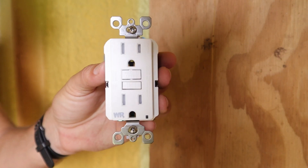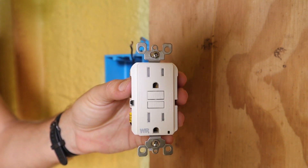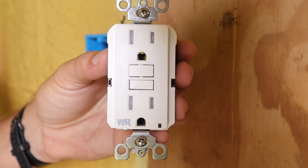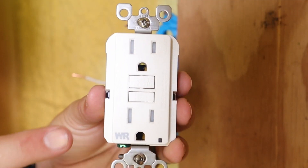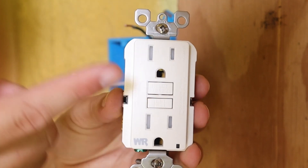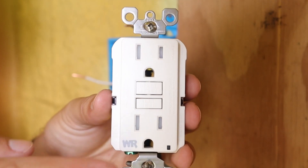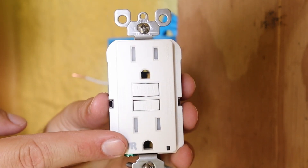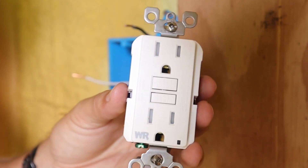The first thing I'm going to wire up is my outlet. This is a GFCI outlet and you really need these in any wet locations — out in a shed, a garage, kitchens, bathrooms, and anywhere there's moisture. This particular GFCI also has 'WR' marked on it, which stands for weather resistant. If you're putting this outside where it's exposed to the elements, you need a weather resistant GFCI and not just a regular one. If you were mounting this outside, you would also need a weatherproof box on top of it.